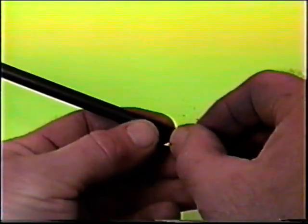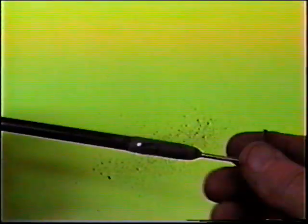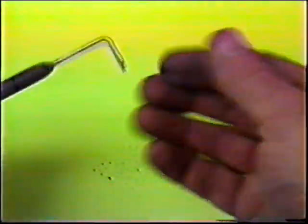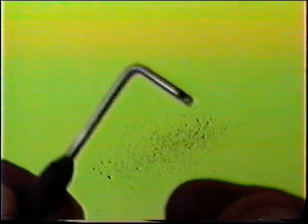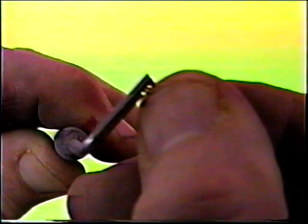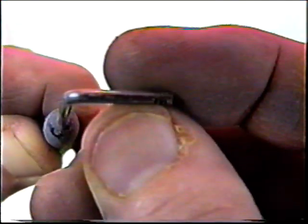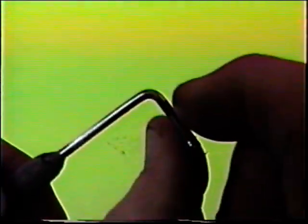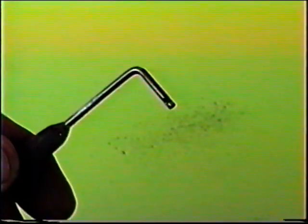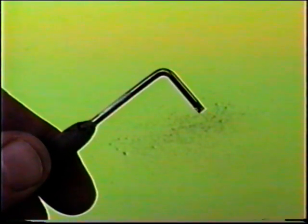Now we're going to leave this end just extra long, because once this gets into the fuselage, I won't put the back end on this until I know exactly where the control horn is, and then I'll make my adjustable zero-in feature in the back here. But for right now, one end on here. What I also did, I don't know if you can see it, is I put some notches in the wire, just the whole safety wire. When I solder the eyelet in here, I want to have a little safety wire on there. It's a redundancy system, and I use that on all the soldering joints, and always Stay Bright silver solder.